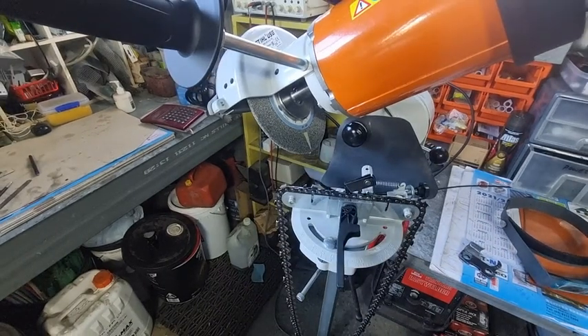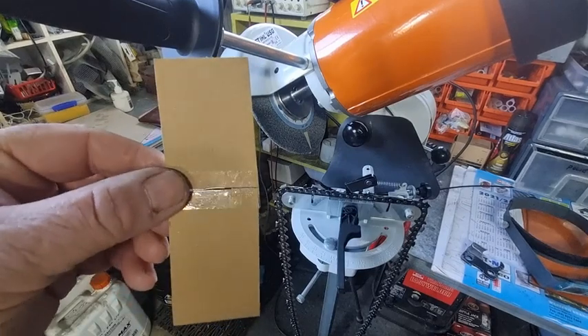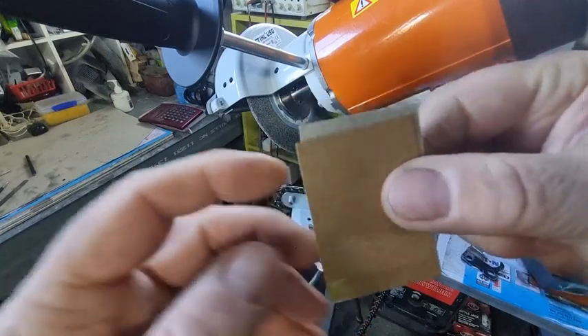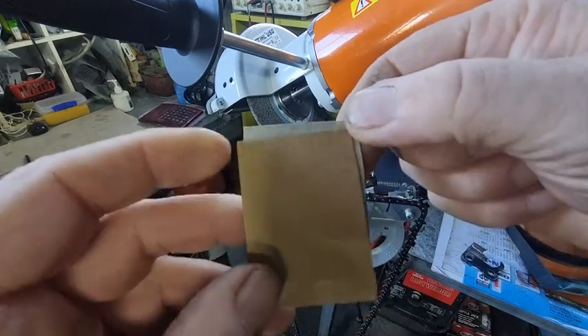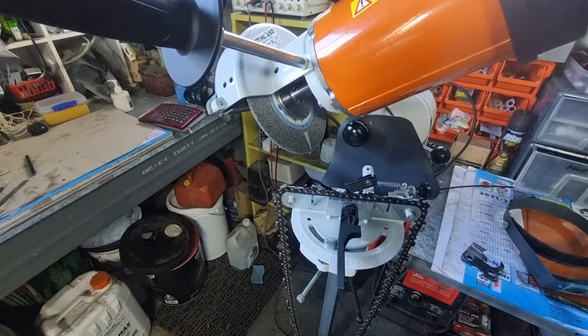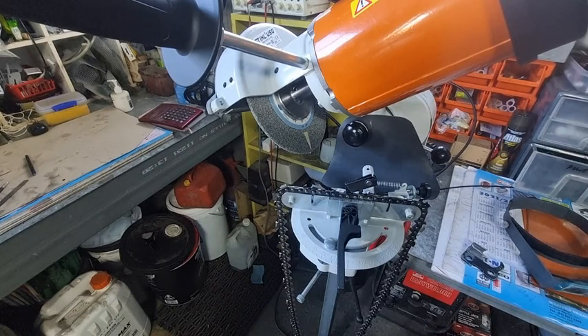To demonstrate this roughly, I've got a piece of cardboard with a three-degree offset hinge — it's not parallel. When you bend it over you can see it doesn't line up at the side; it's offset in its movement. This is exactly what the offset at the back does — it moves away in that direction, and by moving away it aids cooling. That's probably the best information that myself and others currently agree with on the forums: the reason Stihl did that was to aid cooling. I cannot see any other reason. I was always puzzled as to why they offset that, and I'm 99% sure that is the reason — to aid cooling. Thanks for watching, bye for now.